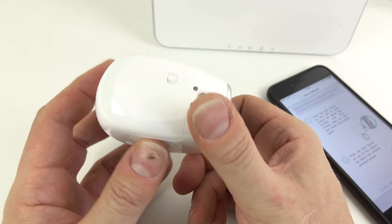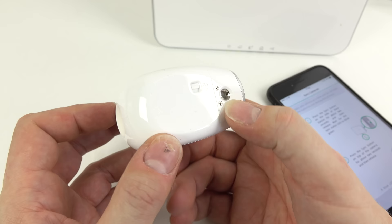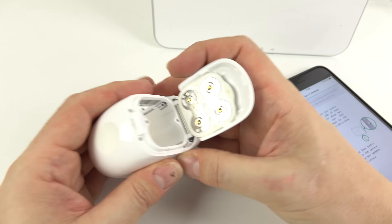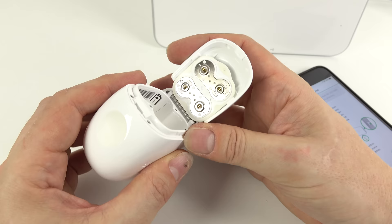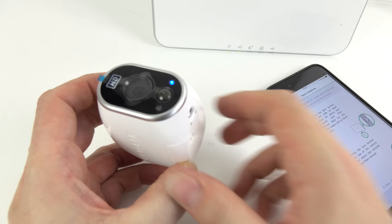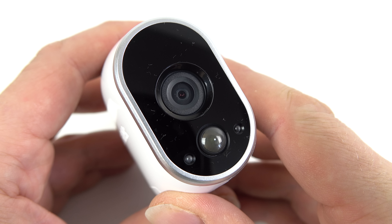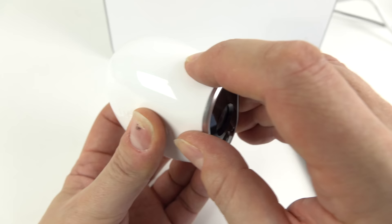Let's have a look around one of these cameras. It's got a flat base so you can put it on a normal surface. On the back there's a rubberized indent which attaches to the mount. On the base there's a tripod screw hole, so you can put it on pretty much any kind of tripod mount. The bottom has a battery compartment with a rubber seal to stop moisture getting in — four batteries go in here. These lithium cells aren't rechargeable; they're single-use. You could use rechargeables but it's not really recommended. On the front we've got the lens at the top, a motion sensor at the bottom middle, a little indicator LED, and an infrared illuminator to light up areas once it gets dark.